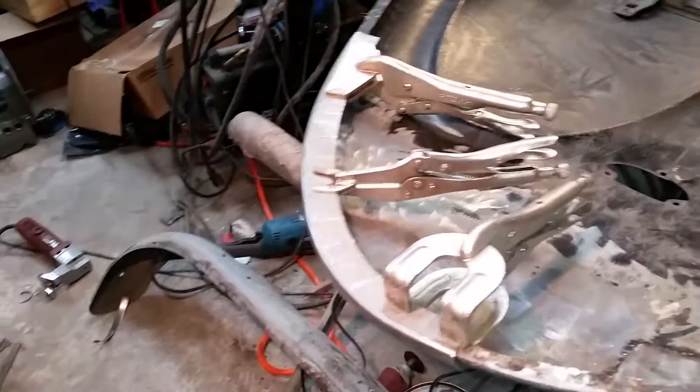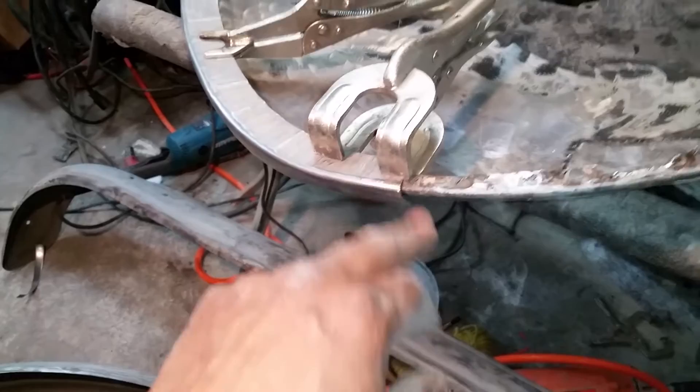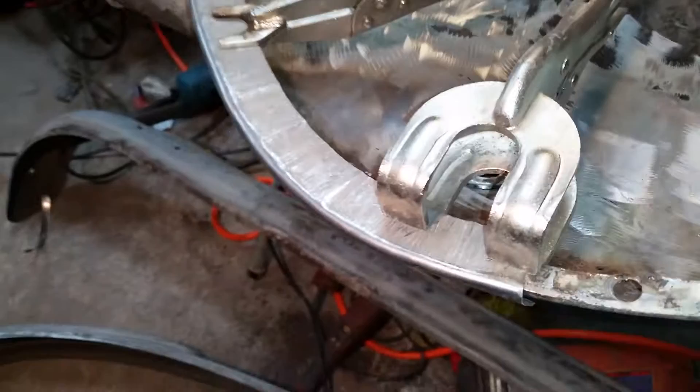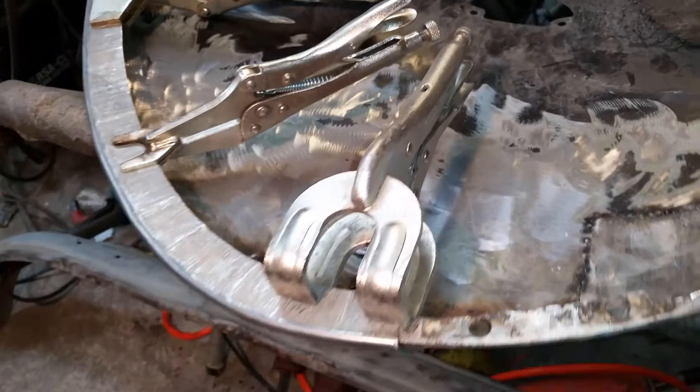This is the lip I'm working on. I have half of it already worked out. These little lumps are going to be fine because I'm going to take a grinder — as you can see this edge is a little bit sharper here, and my fold because it's rounding makes it hard to get that sharp. I'm pretty sure things were basically stamped and cut into shape. Once I get this cut out I'm going to grind this down with a grinder and it should make a flat edge right here. Let me turn this thing over.